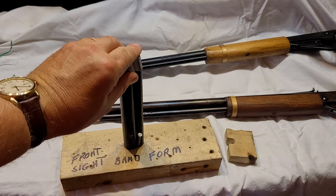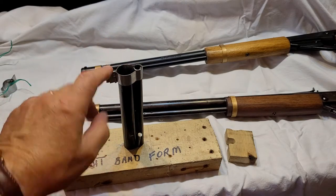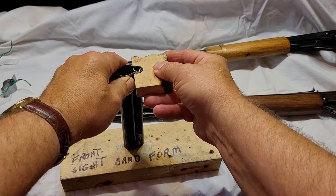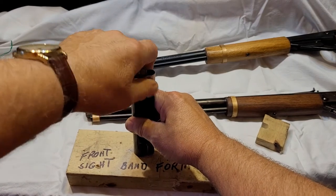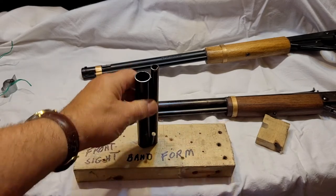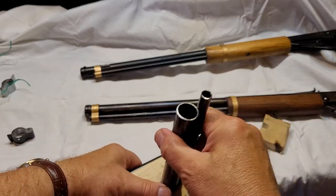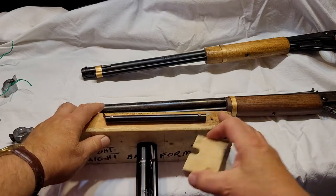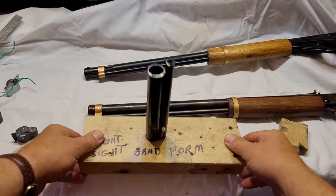What I ended up with was a piece of steel that would fit over top of the form. I took the rest of it, pinched it, brought it around to the top, and let it be bigger than I needed so that I could work with it. This gave us the basic form. Once I had that in there I was able to keep the size properly, and this form acts as a good replica for the gun itself — you don't need to actually use the gun as the form and perhaps damage the front of the rifle. In lieu of hammering on the form, I just took a little piece of the fake magazine tubing and hammered it down over top to start from that point and make my form.